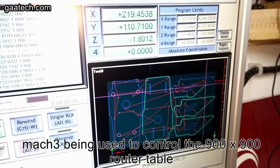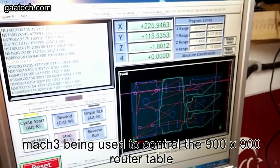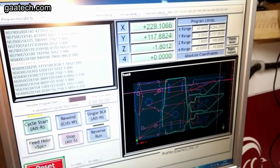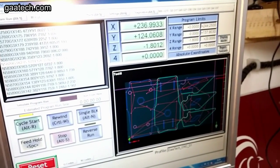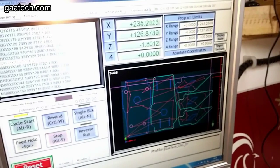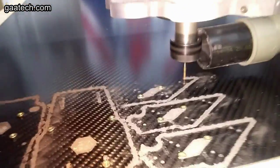There's Mach 3 — the big screen shows the parts we're cutting, the DROs flashing show XYZ where the spindle is moving, and on the left-hand side all the numbers is the G-code which the computer is following to actually cut parts. It looks very complicated but once you get your head around it, it's actually quite easy, and a lot of the functions you don't use anyway.